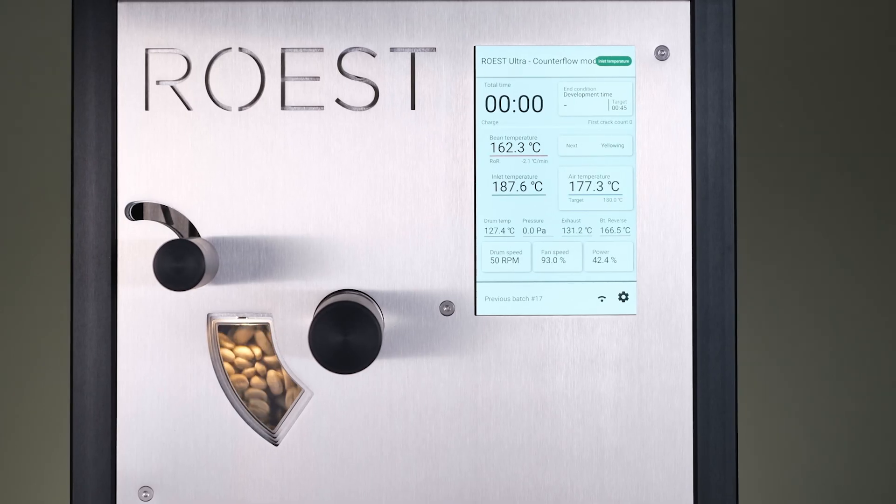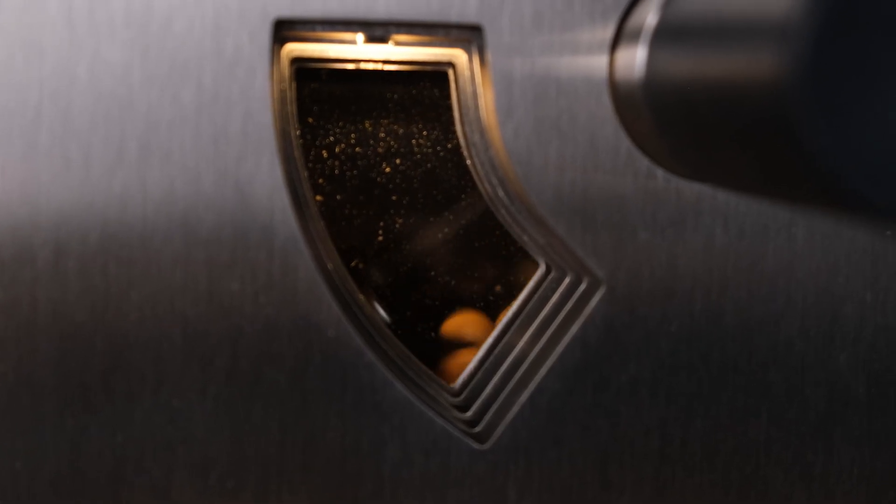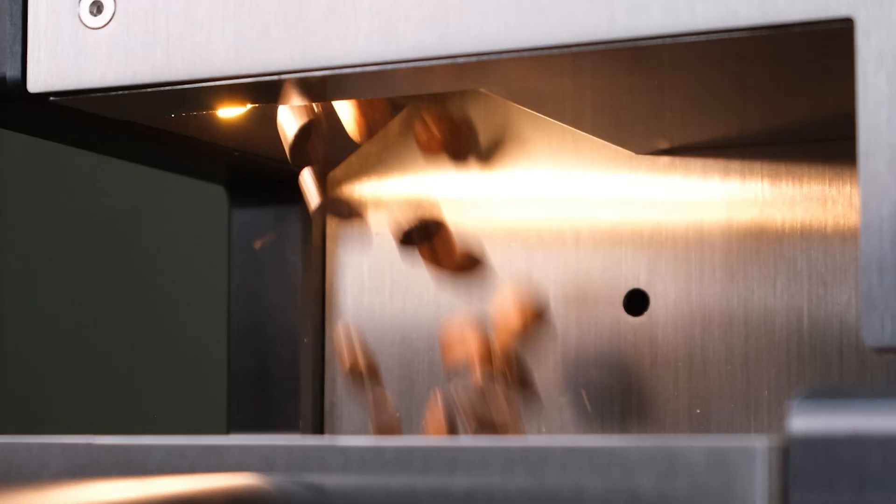These changes apply to all 200 series machines, but there are also a couple of big changes unique to the Ultra — and the biggest of those is counter flow mode. This is a massive change to the way the machine works, allowing you to roast much faster or at much lower temperatures than ever before. It's a huge leap forward in workflow and also allows much more gentle roasting for the more delicate coffees in your lineup. In short, the new mode can easily double your throughput — you can now roast up to three kilograms an hour on this little machine. To enable the new mode we put in a second bean probe, optimized for better data at smaller batch sizes. The Ultra also includes a built-in drum pressure sensor, which is vital for optimizing airflow settings and allows much easier calibration between different machines so you can get the same result in different installations.